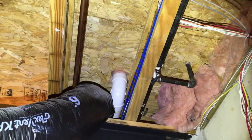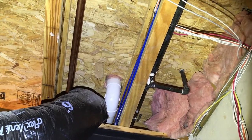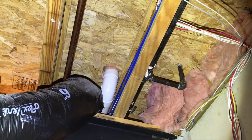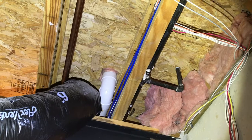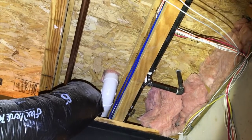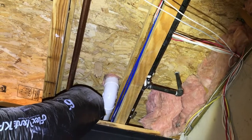Let's continue along the ceiling and follow the plumbing. Just on the opposite side of this beam, you will notice that the radon pipe makes a 90-degree turn and goes straight through the ceiling. And in most cases, for code purposes, that radon pipe has to go directly up from this point all the way to your roof in a straight manner without any additional turns.